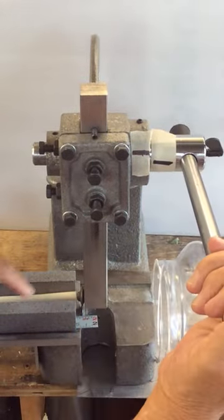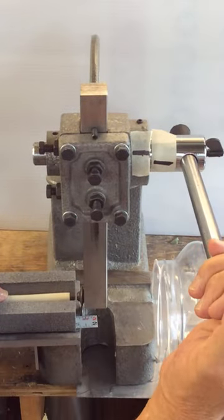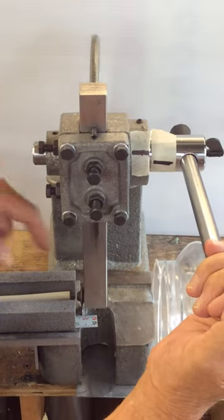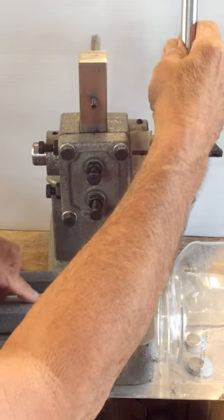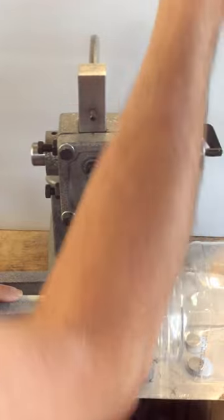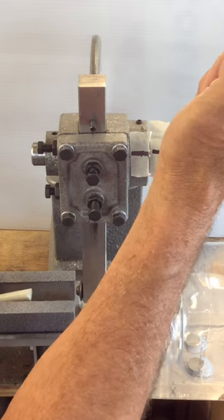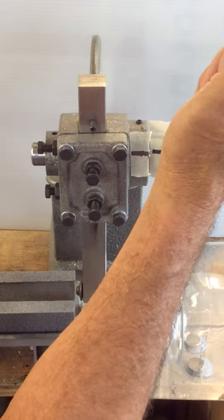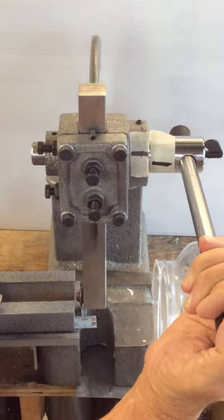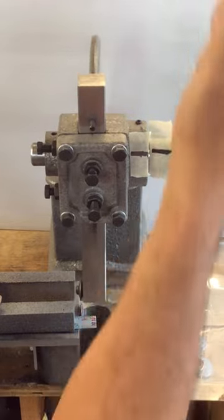Also keep in mind that when we cut cane, we don't usually need to go all the way down to the bottom — meaning when this pin stops it. That pin is to stop these blades from crashing into each other. What we usually do is just give it a short little burst. Right here is where I felt good about pulling it, even though the handle goes all the way down to here. I don't operate down in this level; I operate up here in this level.